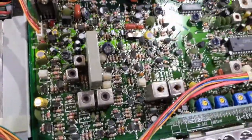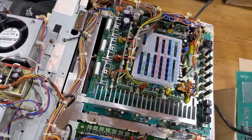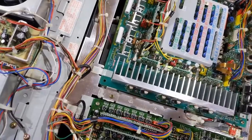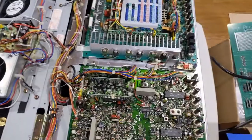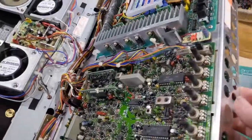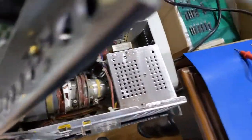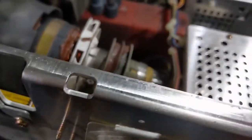We have a waveform board on top and then a signal board next to that. I can tell this is the signal board — we've got a couple of delay lines here and all of the other components. No surface mount electrolytics. I want to check if there are any signs of leaking electrolytics. The small signal caps are probably fine at this age, but the low ESR types in the power supply may have a problem. Oh yeah — this thing hinges up. There's a kickstand!